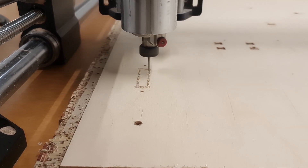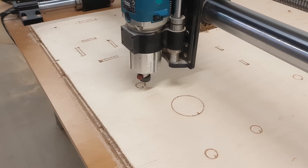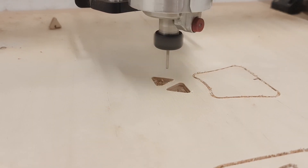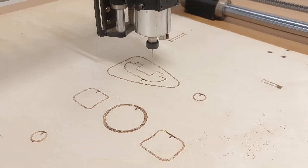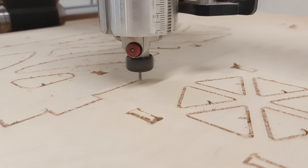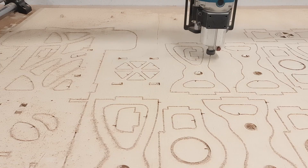The first prototypes were traditional looking four-wheel go-karts, but the cordless drill wasn't powerful enough to make the cart move, so we had to switch to a three-wheel option. The three-wheel design would have less wheel resistance, be lighter and therefore require less power to drive. The problem was that we had to redesign the whole project and go through the same testing cycles a couple of times until we found the solution that worked, but more on the design choices later.